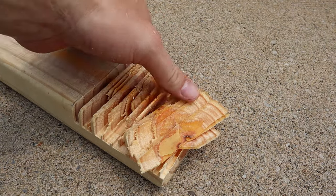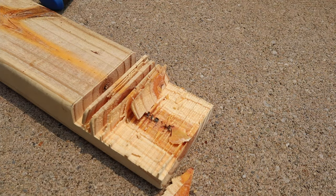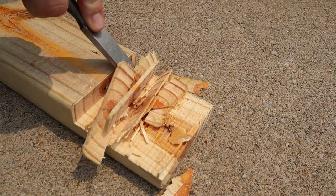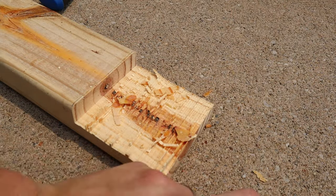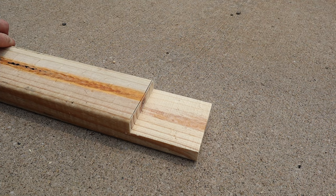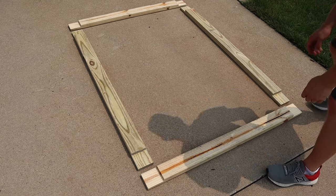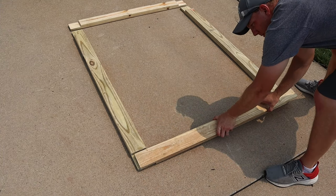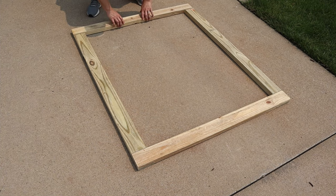The remaining parts of the board are pretty easy to break out by hand. You can do this by hand, or use a chisel or even a screwdriver to help pry them out. After all of them were gone, I took a chisel and ran over it just to clean it up so they fit together really nicely. The next step is to check the fitment of all the joints — just lay the boards over top to make sure all the lap joints fit together tight.